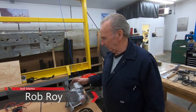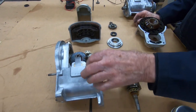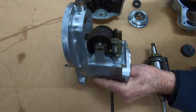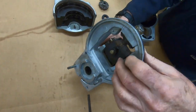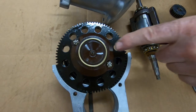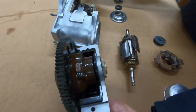I don't know how many of you have ever seen a magneto up close. We've left one side complete; the other side we've broken down into all the components that make up a magneto. You start off with this one here — this is the frame of the magneto, the solid part. It's got two iron core side frames in here and the magneto coil is sitting across here. The output to the spark plug comes off here and to the magneto rotor.